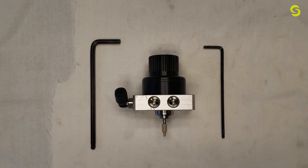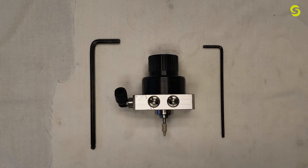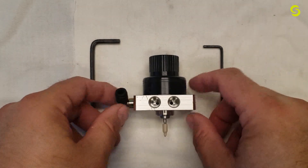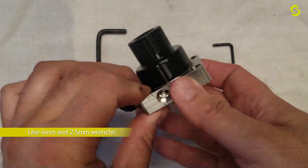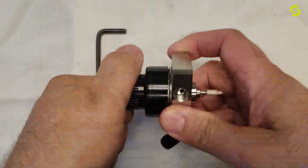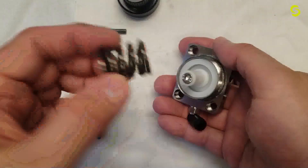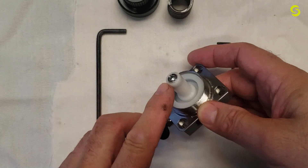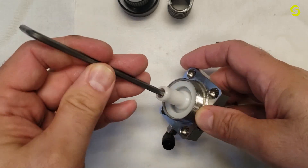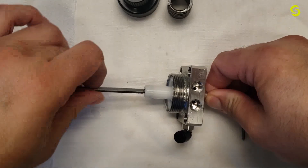In this section we will show three new products for the Cyclamix Evo manifold. Starting with the injector valve assembly — to disassemble it, you'll need a 4mm and a 2.5mm wrench. Begin by removing the air cylinder housing by unscrewing it. Once removed, take out the piston spring. On top, you'll notice a 4mm screw holding the piston in.